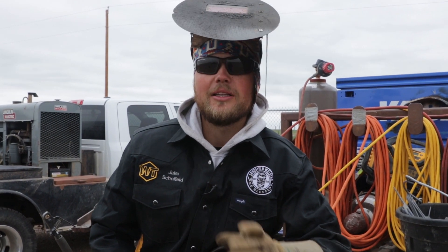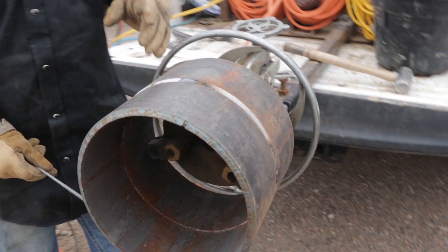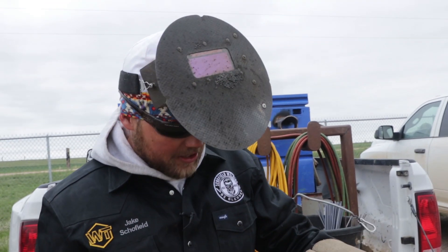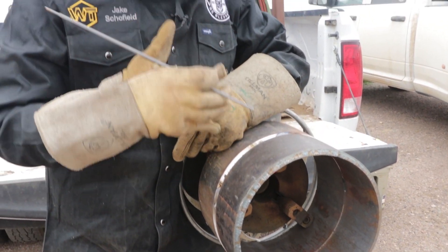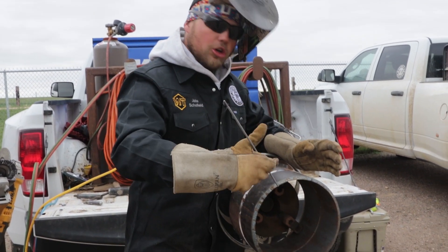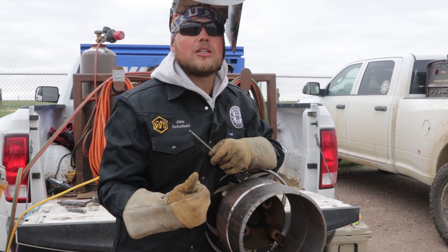Welcome to the messed up fit. We got this tacked up on purpose to make it hard, but also to show you that not every fit is going to be perfect. On this side we've got a pretty wide side — over an eighth inch wide. You're gonna notice a lot of fingernail. Many people want to take their hand away from the fingernail and try to have that arc burn it off — it doesn't work that way. You take your hand to the fingernail, and if it's still not burning off, put pressure on that bevel to help run that root in better.